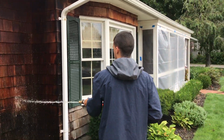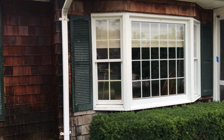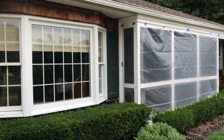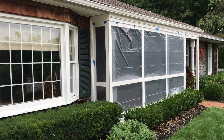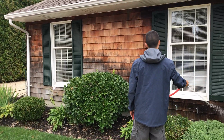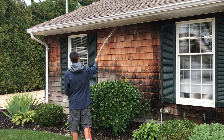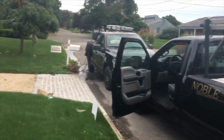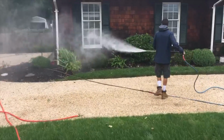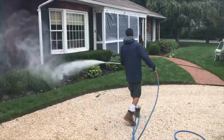We have already taped off a screened-in porch, because when you take off these fibers on the top layer that are filled with mold and algae, they will actually stick onto the screen. So you want to make sure all the screen windows are taken off before you start cleaning. Right now he's rinsing off plants just to add a little barrier between what's going to come off